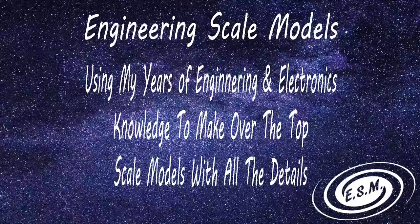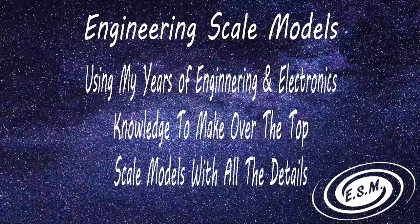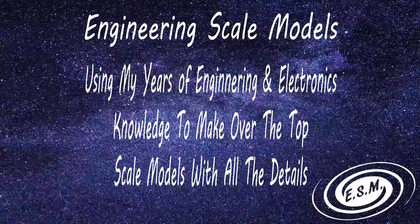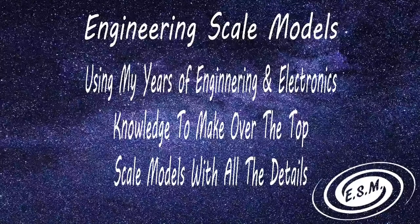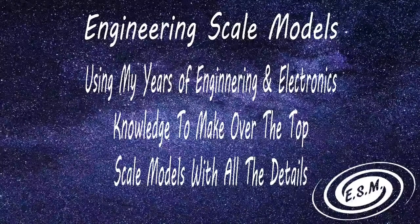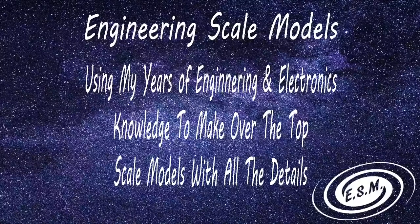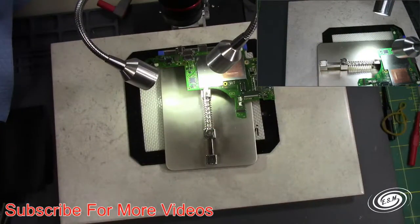I am doing another live stream today on Sunday because I am going to change an M92 chip on my Nintendo Switch that I believe has an M92 chip problem, and I have talked about it with the coder. Let me just say that I'm live here. So I have this switch. It draws a small charge current with the battery connected, but talking to some people online, especially the coder on his channel, we think it's the M92T36 chip.